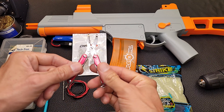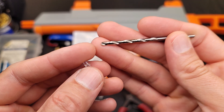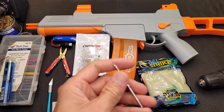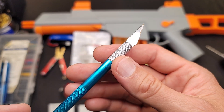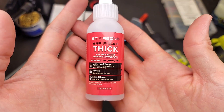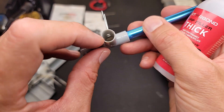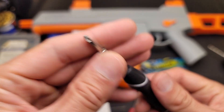The tools you'll need are a wire stripper, wire cutter, and some flush-cutting snips which will make your life a lot easier. You'll need a drill bit to drill the hole for the LED — this one is sized just a tiny bit smaller than three millimeters so you can really wedge the LED in there and it's not going to be loose. Then I'll glue the LED in place. This is a number 33 drill bit, just a little bit under three millimeters. You'll also need a drill, an exacto knife for a little trimming and cleanup after drilling, a soldering iron, some thick super glue or hot glue to hold the LEDs in place — don't use thin super glue as it will run and risk damaging your T-piece — and you're going to need some solder. Finally, you'll need a number one or number zero Phillips screwdriver to take apart the blaster.